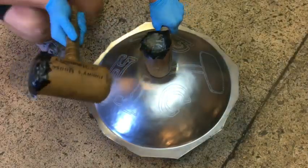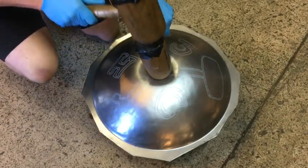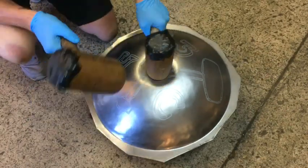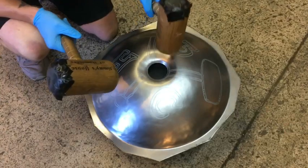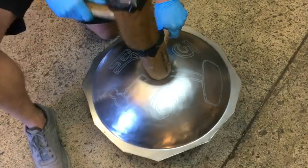So I come over to this side to see if I can get a better bite, kind of over by the H of the Three Hammer Challenge logo. Didn't bite quite as well as I wanted to. It's probably just that the shell shape was somewhat irregular because I did it by hand. But I think I was able to clean it up enough.